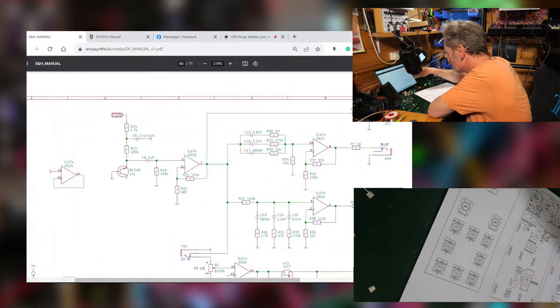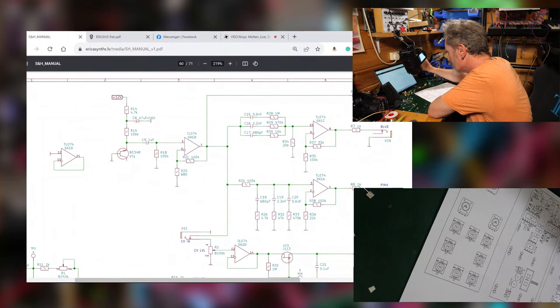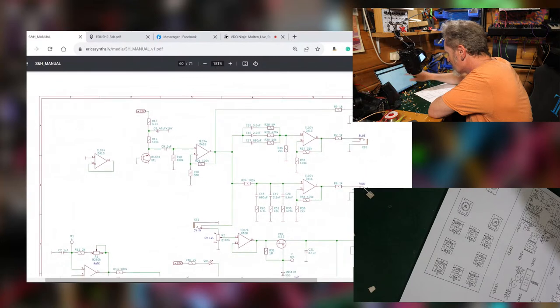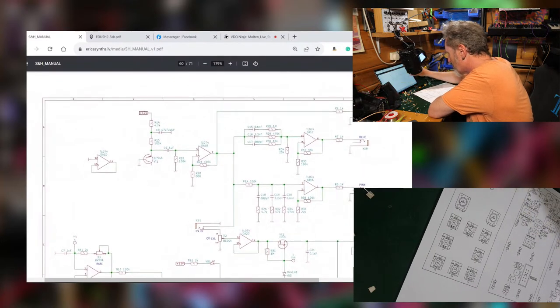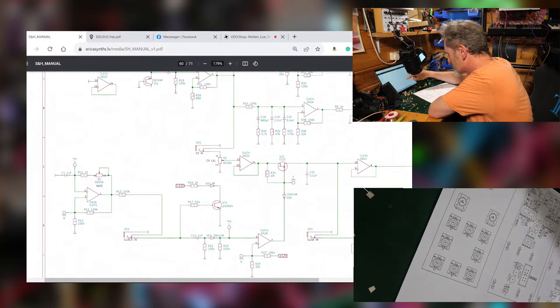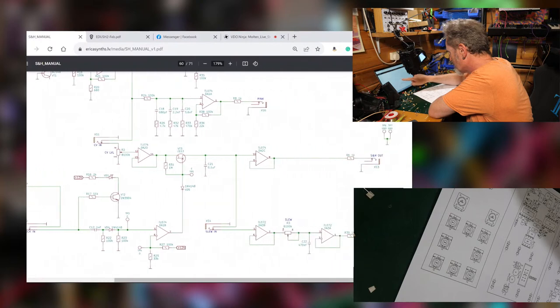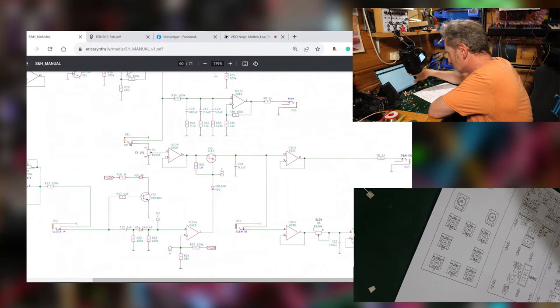Three inputs. So these appear to be the noise generators over here, white, blue and pink, which was made through breaking something, wasn't it? Breaking a transistor. Oh, right. So you're breaking a transistor to create white noise, and then blue noise and pink noise is created by filtering off a little bit. That's right. Good. Then we have the input going through this JFET. Aha! I'm remembering. Which enables us to do the sampling.